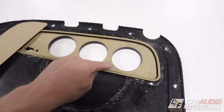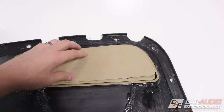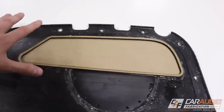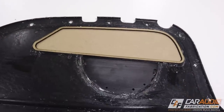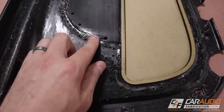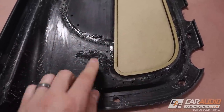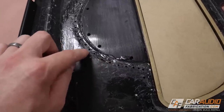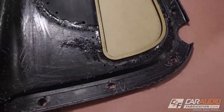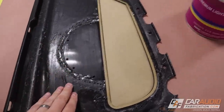To prepare for the body filler phase, I don't want any body filler on this surface or accidentally on the inside of these rings we're going to see in the finished project. So I cut a little piece out of chipboard that matches the shape of my insert and tape it in from the backside to help protect. I also drill a ton of little holes around the outside edge, in a spot that will be underneath the fillet of body filler I'm going to add. The body filler can flow through and create a plug on the backside for a mechanical hold, so I don't have to rely on it getting a super good bite into this material. The body filler I'm going to use is Evercoat Rage Gold — it goes on really nice and smooth and is extremely easy to sand.